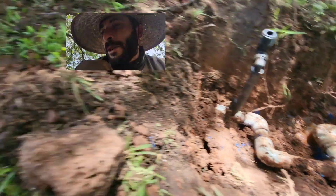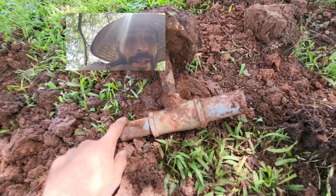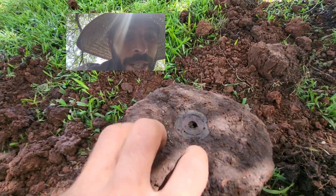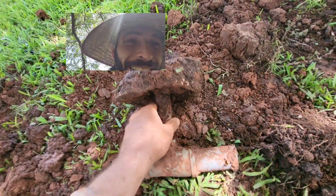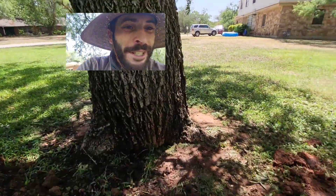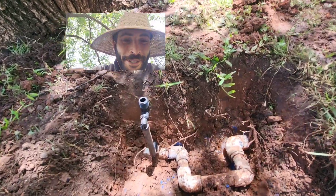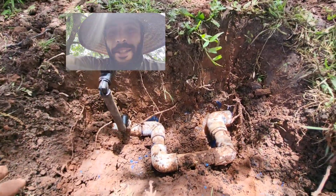What actually used to be here is pretty cool — you can see this pipe: you've got the inch and a quarter, you've got the fitting, then it reduces down to one inch, then goes up into a brass riser and a brass sprinkler head, and then they concreted around it with a doughnut. Oh my god, nightmare. Plus it was right next to a tree. When I turned up and saw this leaking and came over and saw the head, I was like, oh no, this is going to be an absolute nightmare.